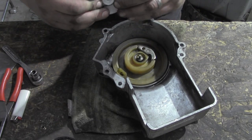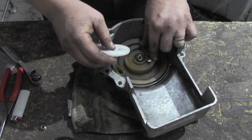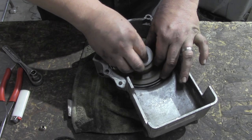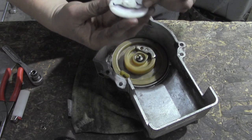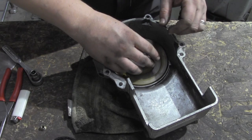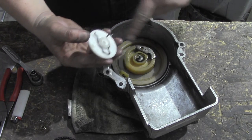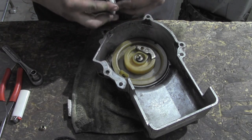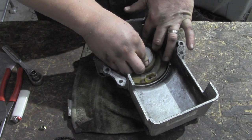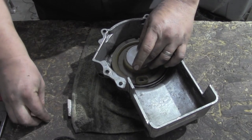This little disk — that little bump right there lines up on the dog. It fits on one way: there's a notch here and a notch inside the pulley. That bump out here needs to fit up against the edge of the dog — that's what the dog hits when everything actually runs.